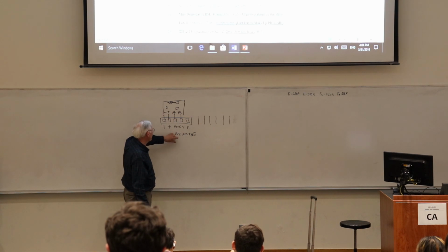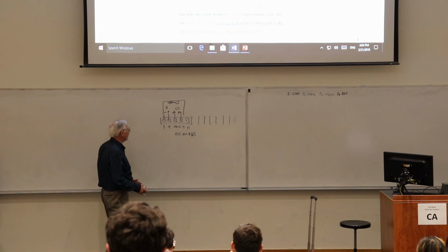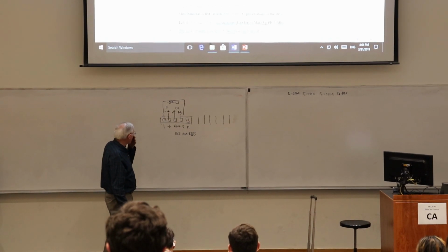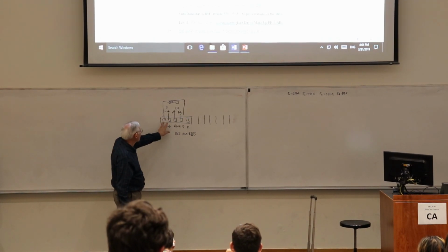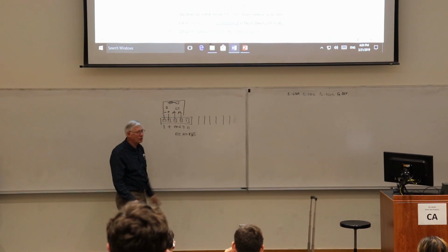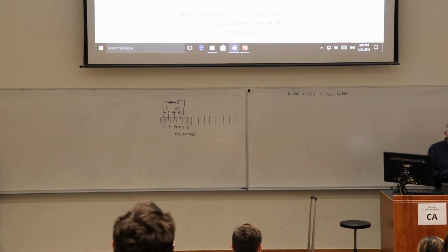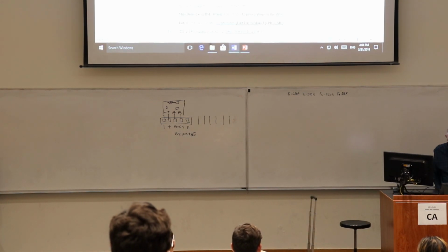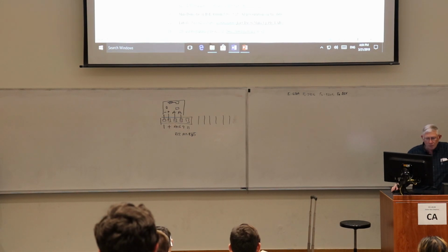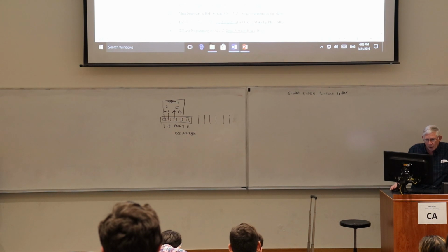And once you get this board plugged in, it's automatically all hooked up. If you plug it in the wrong way, it probably won't be the end of the world, because the big problem is somehow powering these backwards. As long as you don't do that, you won't burn up the temperature sensor. The photoresistor is completely inert. You can't hurt it except by stepping on and crushing it, I guess, and even that's hard. So they're pretty robust. And the photoresistors are super cheap. The temperature sensors are more like $1.50 a piece or something, so they're not super cheap.